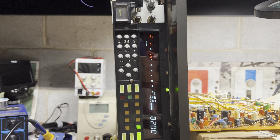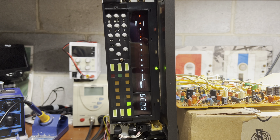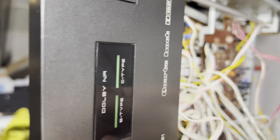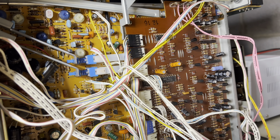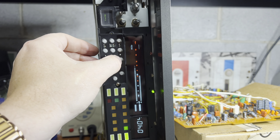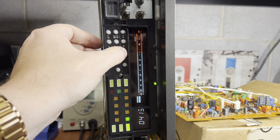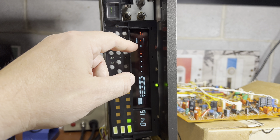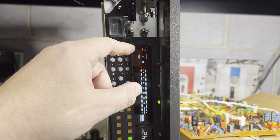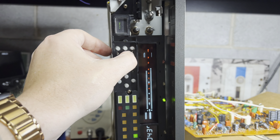Something here is blinking. The problem was on this indicator board — I bent some parts and it started to work in all modes. This is the mode for VU meter — Dolby plus three and plus five, or plus six and then plus eight. So Dolby plus three and plus five levels — we can clearly see it here. On this Sony deck, Dolby is plus three and four, so it would be two, four, six decibels above zero.